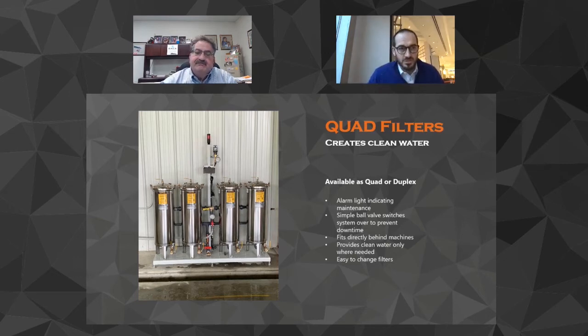So one of the other questions, Eddie, that came in while it was through was the abrasive garnet. Can it be filtered, or, you know, is it biodegradable, and the possible recovery of the wastewater? So I think, and correct me if I'm wrong, but you're recycling 100% of the water inside of the shop, whether it's coming from your CNCs, your saw jets, all of it. The abrasive garnet that's in the water, it gets into the trenches, it goes down through the system, you know, is just like any other sediment that's coming into that system, and it's getting pulled out and filtered just like the stone dust is as well, right?